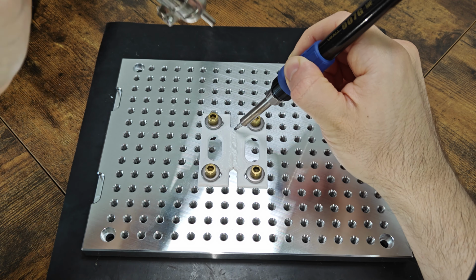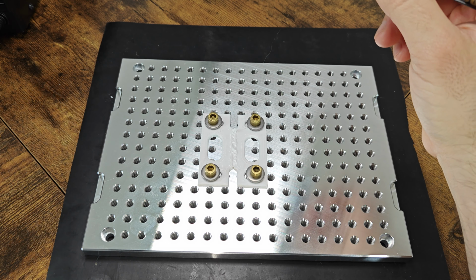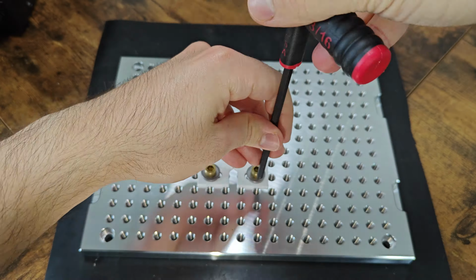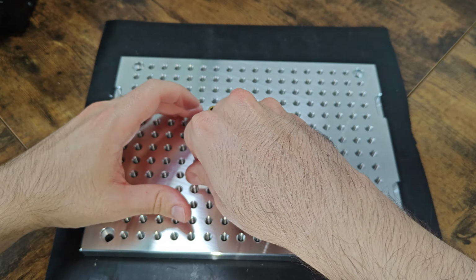After you're done welding the one side, stop for a minute and let the part cool. You can use a fan or some other source of cool airflow to help cool the part. After you complete one side, flip the part over and complete the others, and therefore the shell.